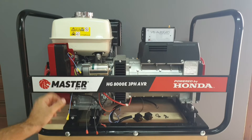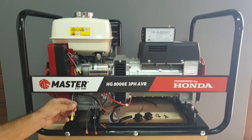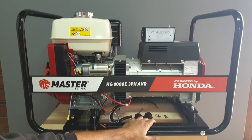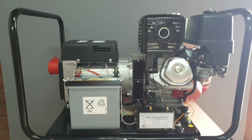A lot of the wiring has already been pre-done, but we will guide you step by step on what everything does and how everything is connected. We're going to connect two relays — one to stop the engine and one to start the engine. This particular generator is going to a local customer and we're going to be fitting a V6 Autogen with a LoRa module because it's going to communicate with a LoRaGEN controller.